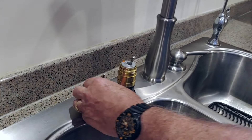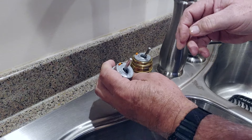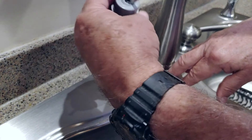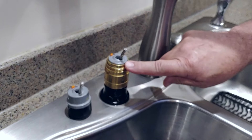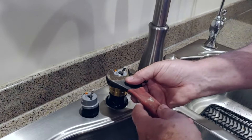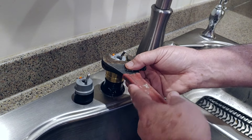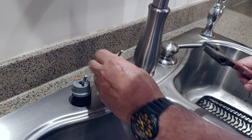Now we are down to this piece. I'm just going to note the limiter settings — it's just slightly away from the left, and that's the way we're going to set the new one. That's the off position. It's going to go in the same way, and there are little locator pins at the bottom that make sure you don't put this in backwards or sideways — it can only go in correctly. This is the bonnet nut, and you're going to find this in all of these systems. Take yourself a large adjustable wrench — it's brass, so be careful. Adjust it till it's nicely snug so you don't round that off, then start turning. As you can see, it's pretty finger-tight. Off it comes.